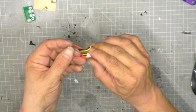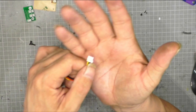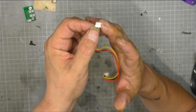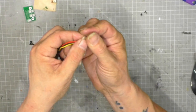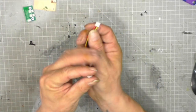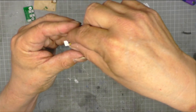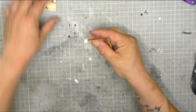Oops. And they are connected on the end with what's called a JST, I think a JST, correct me if I'm wrong, it's a Japanese solderless terminal. It's a system where you crimp things on and then pop it into the housing. And then we have two ends exactly the same. These are both male ends. A male end goes into a hole. The female is the hole that receives something.